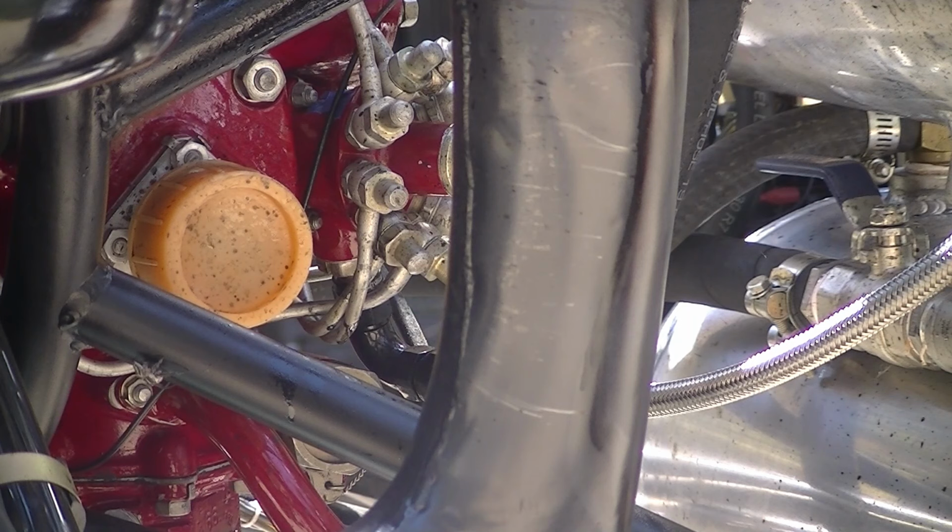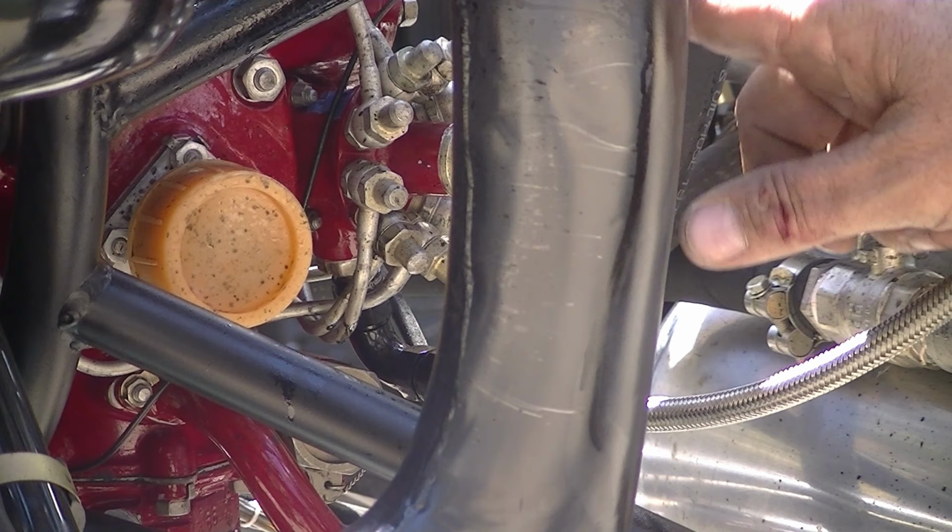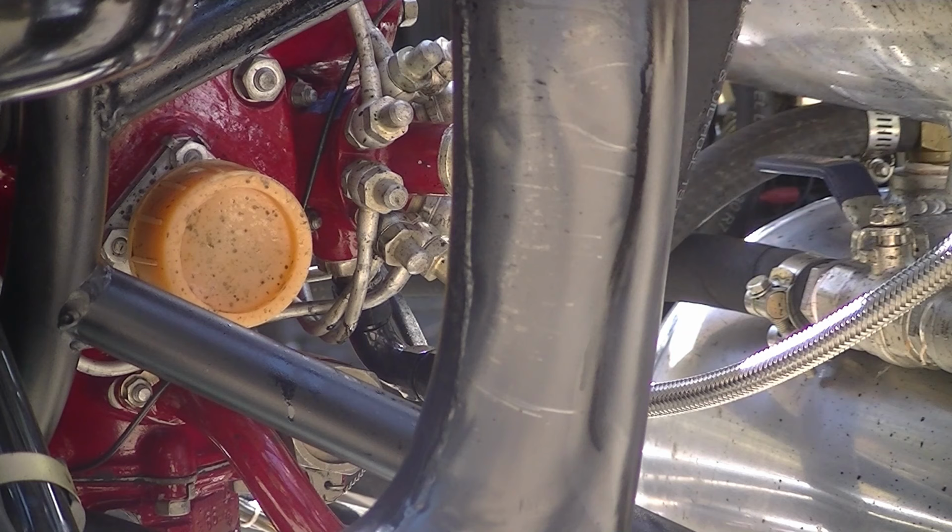So when we're going to start the engine, I drop this valve at the back here. The air comes through the cylinder, through the valve, into this distributor arrangement here. So in here is where the high pressure air comes in. There's a little rotor inside there that points to one of these tubes, and that tube runs around to whichever cylinder it is. So when the air goes through, it goes to that cylinder, pushes that piston down, and as the engine turns, the rotor moves to the next cylinder, so the air gets distributed to each cylinder in turn to rotate the engine around. So once the fuel and spark's introduced, the engine starts and runs.